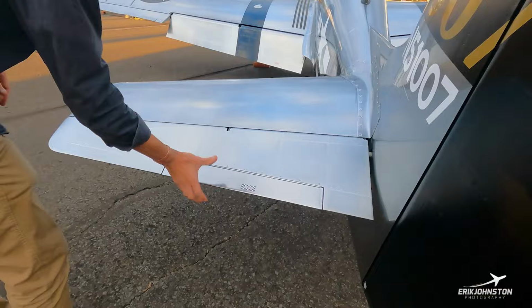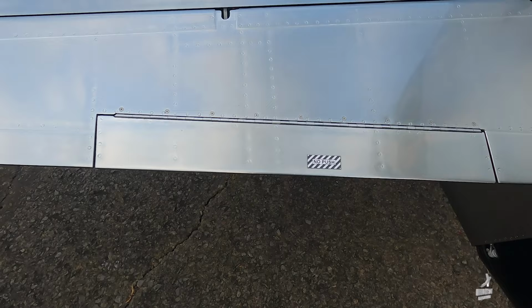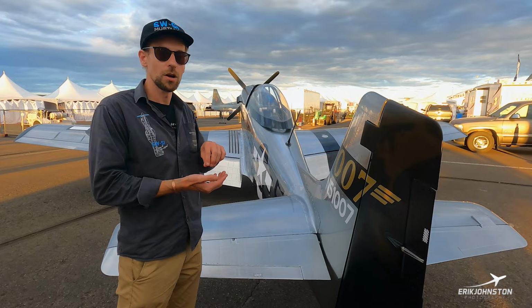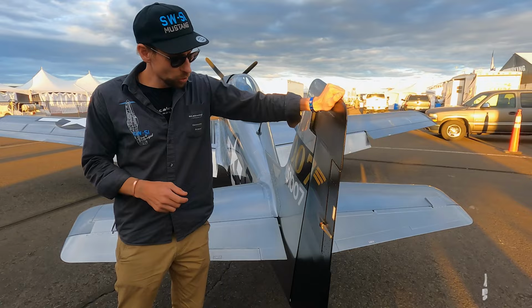And we have in this aircraft installed a two-axis autopilot. The autopilot is not running the trim tab. We have put the autopilot servos directly on the push-pull rods of the elevator and the aileron. The rudder is not connected to the autopilot. It's simply not needed. The two axes are more than fine.